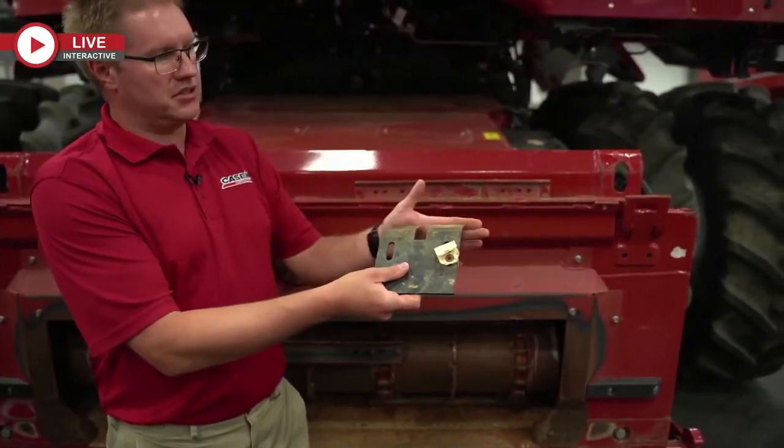The other 300-hour point that's kind of hidden is right here on the drive shaft — again, we've got the shield taken down. On the grease chart, there's always something shown on the unloading auger area; that is for the older combines where they had a tensioner with a spring gauge, just for greasing the slide. It's not on this combine — only for the older 20 series combines.